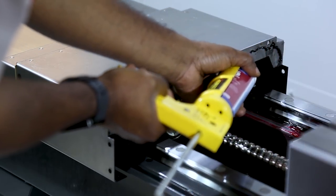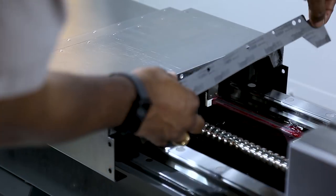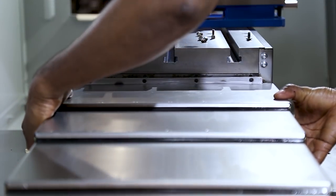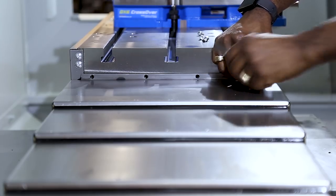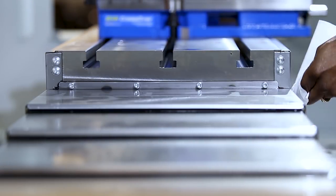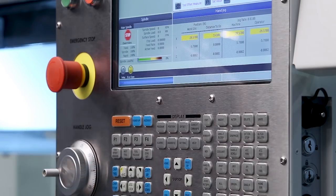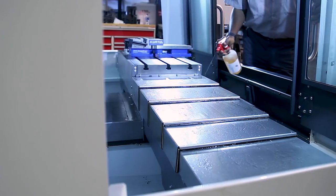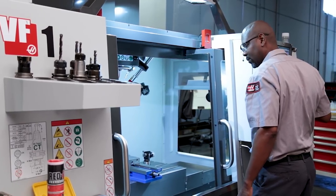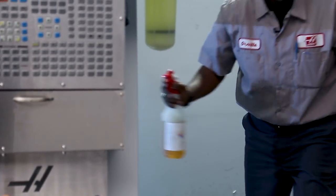Fully extend the wiper one leaf at a time to make sure the sections don't separate. With the largest leaf of the wiper away from the table, put a bead of RTV silicone followed by the new gasket on the face of the wiper. Attach the wiper to the table, install the fasteners, and wipe away any excess silicone. Release the e-stop and press reset a couple times to clear the alarms. Apply a light coat of oil to all sections of the wiper cover and jog the X-axis slowly to make sure the wiper does not bind. Follow the same process for the other side.